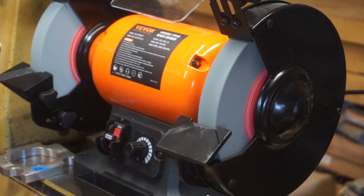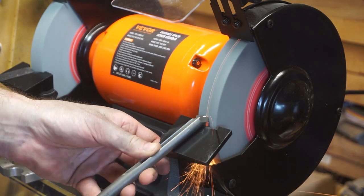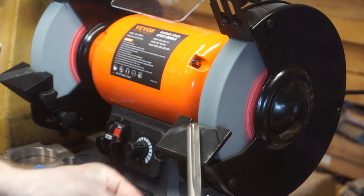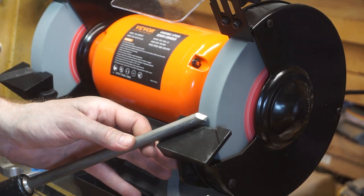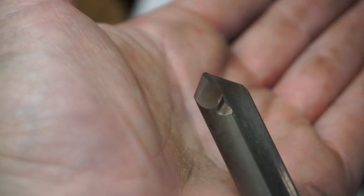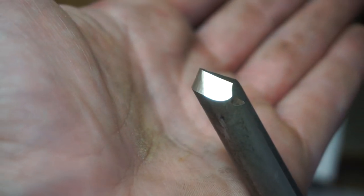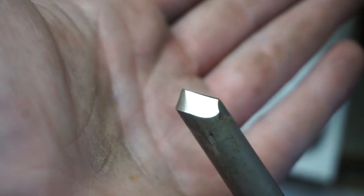When you're having to resharpen your 40-40 grind, it only takes one or two passes. This is just taking so long because I'm reshaping the whole tool. And there we have it — a 40-40 bowl gouge. Remember that you can only put a 40-40 grind on a V-shaped bowl gouge or an elliptical bowl gouge. A U-shaped bowl gouge doesn't work very well.